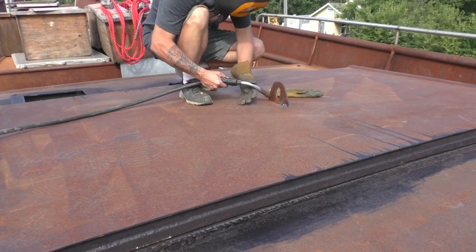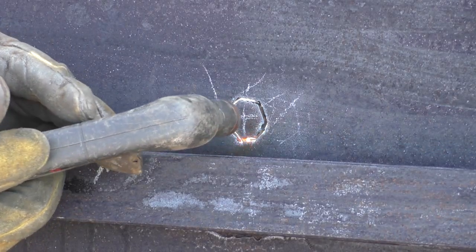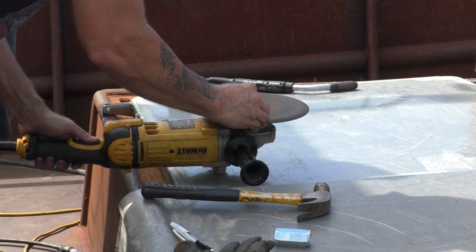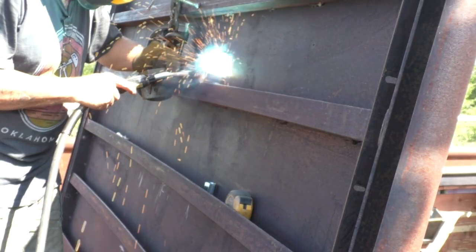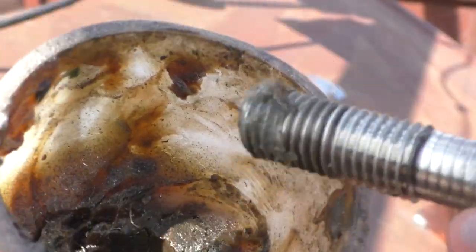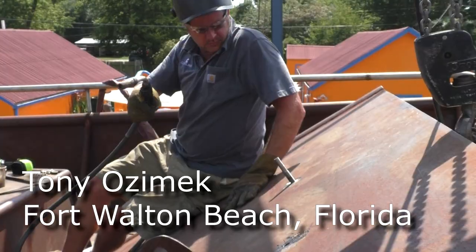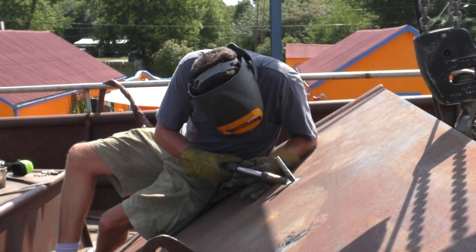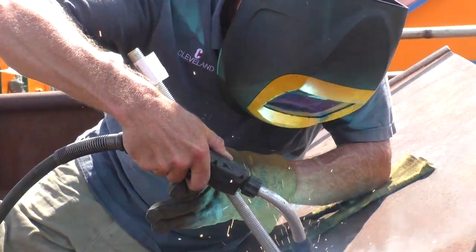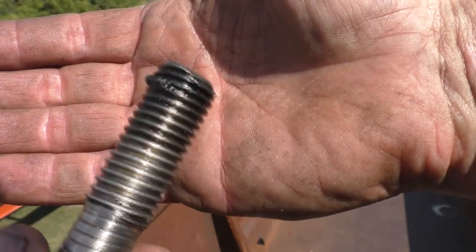Kristen knows that was about to break off. I'll put a little tack in it and then bend it around where we want it. Here's a tip that people give me all the time that I've never used yet — you put your anti-spatter gel or your welder nozzle on a bolt and that keeps the weld from sticking to it. I'll give it a try. That did not have the intended effect because there's some spatter stuck to it anyway, so that's not such a great idea.